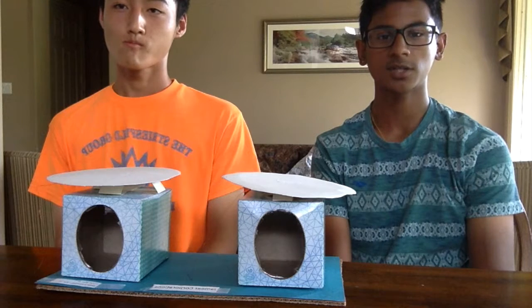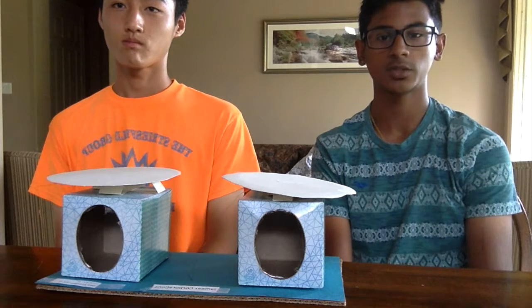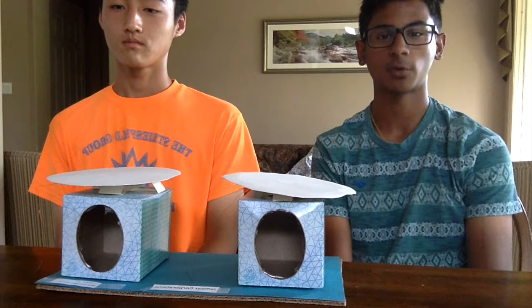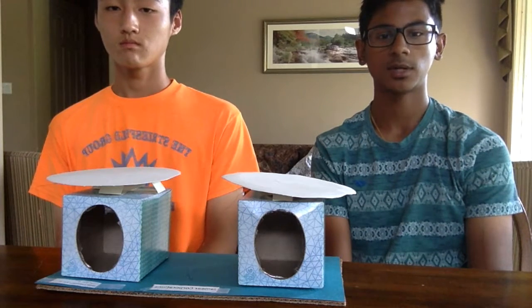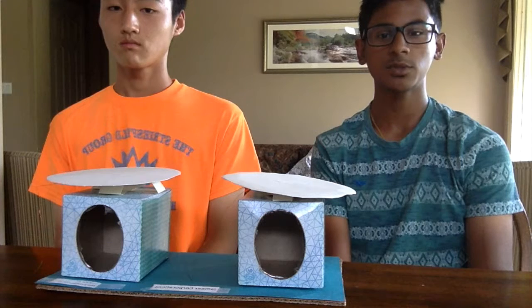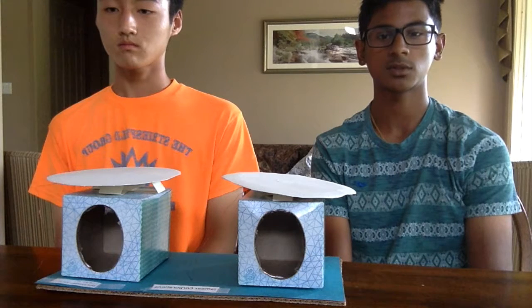As a charge is carried through the copper wire, the direction of the magnetic field is quickly changed. This means that it is rapidly attracted and repelled to the magnet, thereby creating a back and forth vibration. Since the coil is attached to the cone, the plate pumps sound waves into our ears, thus resulting in music. The frequency of vibrations is directly related to the pitch it produces, and the amplitude of the waves influences the volume of the sound.